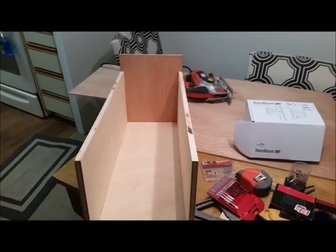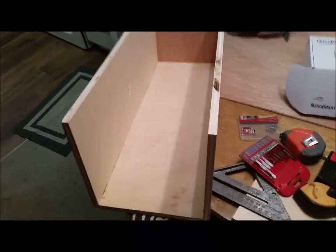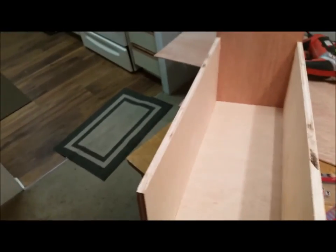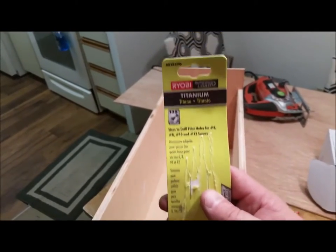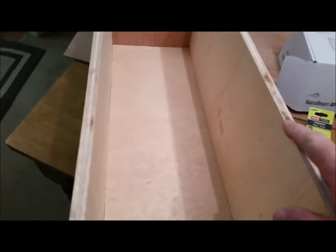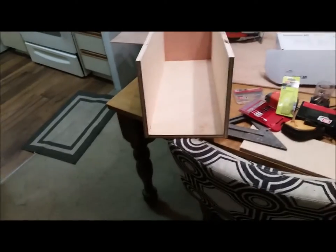The first drawer is completed — definitely some learning curve and some mistakes. I tried using drywall screws and that didn't work. What I found is that number six or number eight by one-inch screws work pretty good, but you definitely need a pilot hole set. Drill your pilot holes, and I did the underlayment in red in the back. The sanded pine pieces came out eight and three-quarter inches — the blade at Home Depot was old and burned the wood badly, so be careful with those guys.